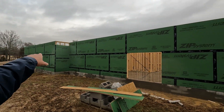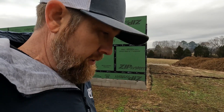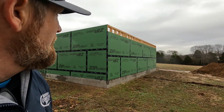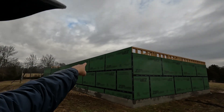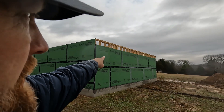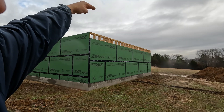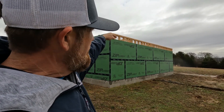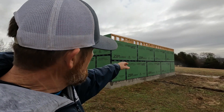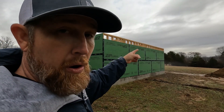If my battery holds up, this is the back side. I did piece in the bottom just because of the liquid flash — trying to hold it off as long as possible to dry. This side goes all the way up because I'm going to have my trusses sitting right there. On the gable end the gable will go up, so I want my ZIP panel to come down onto the wall and then up onto that truss — that way it really ties it in and makes it strong, versus if you just had the plywood stop at the top plate and pieced in a separate piece. You use your ZIP panel as a giant gusset, tying it into that wall, and it makes it really strong.